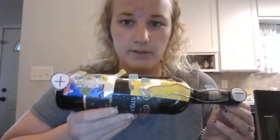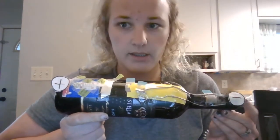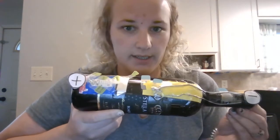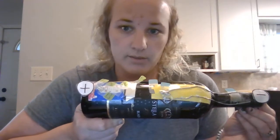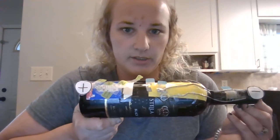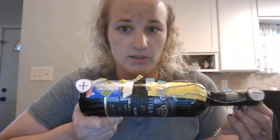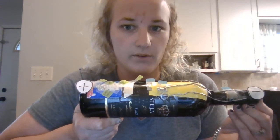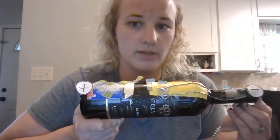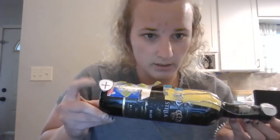So this side is the cathode side. You can tell because of this minus sign. The cathode side is the negative side of the tube. This is where the thermionic cloud is produced, and the high voltage is conducted to the gap between the cathode and the anode, and it focuses the electron stream as it propels towards the anode, which is over here.